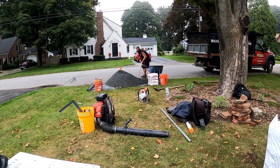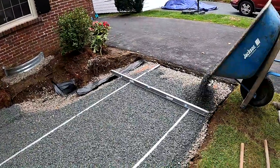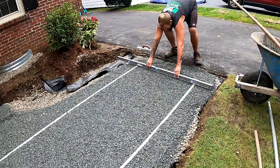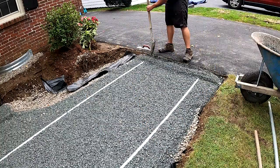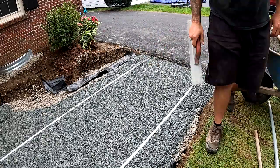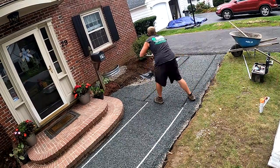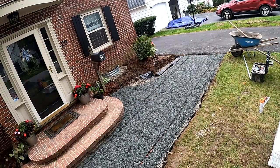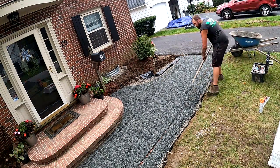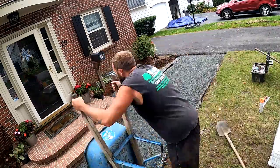When it comes to screeding, I see a lot of people using two-by-fours, and there's really not many two-by-fours that you can buy that are true and straight like a level or a screed rail. So make sure you use a level or a screed rail — something more true than a two-by-four — so that you don't end up with any dips or humps in your walkway or patio. Now I'm pulling these pipes out and I'm going to fill where the pipes were with more chipstone and use my trowel to level it all off.